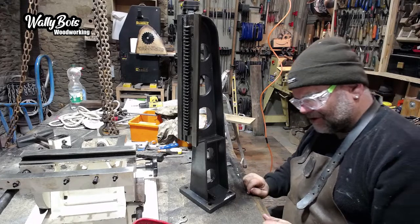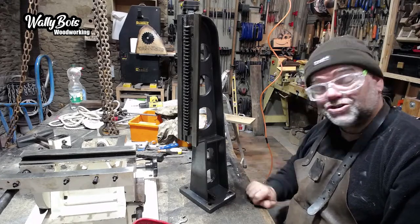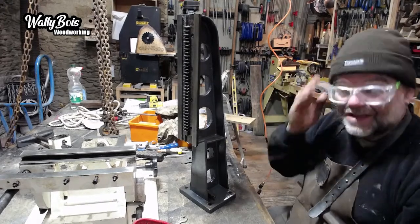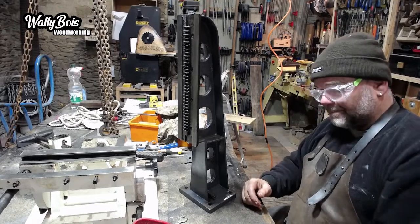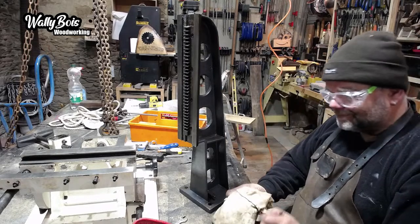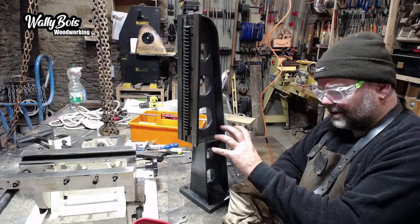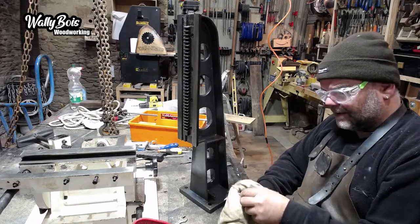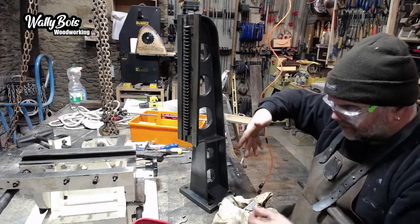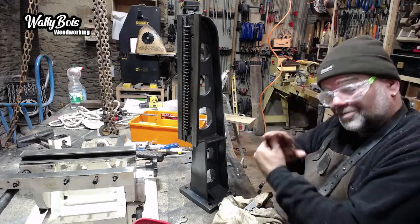Where you put it onto a sled and try to cut the sausage. You can't cut it. You might get a little scratch on it, but it won't actually break the skin. The blade just throws itself down. The only downside is that every time it happens, you have to replace the blade in some cases, and also an actuator, a mechanism in it, that's broken. Because as the blade goes down, this kind of brake goes onto the teeth of the blade and stops it dead.